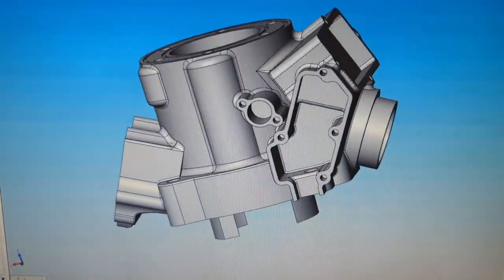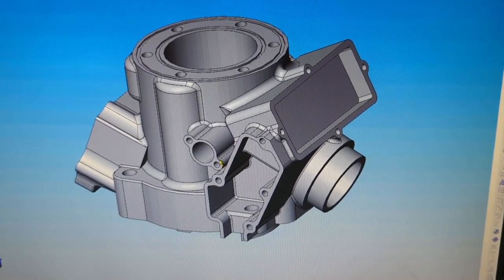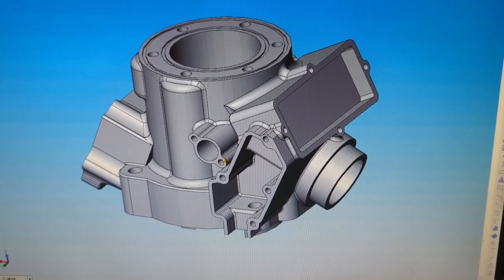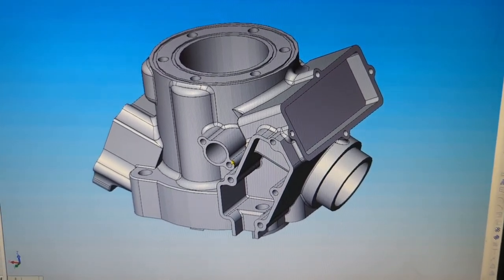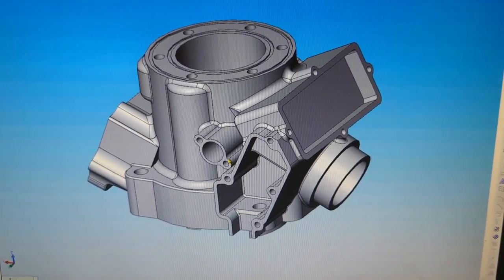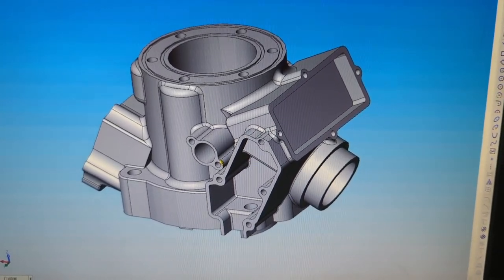This is quite an interesting project. I think the crankcase will be three pieces with a vertical split. The center section is the main section and the outer portions will be more like crankcase halves. I want to make the gearbox like a cassette box — basically you can remove the gearbox as an assembly, set it up on the bench and slip it in the side, like a race car or race bike does.